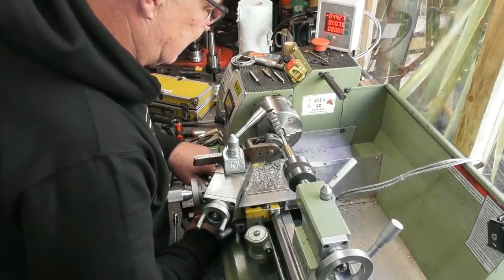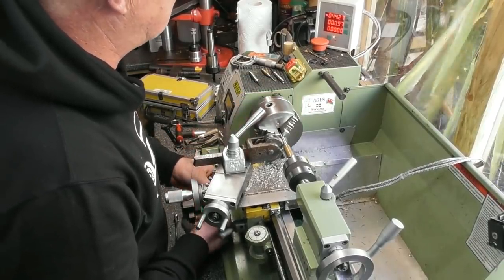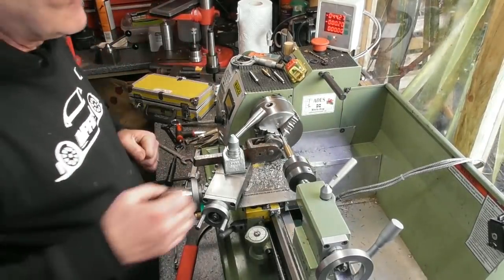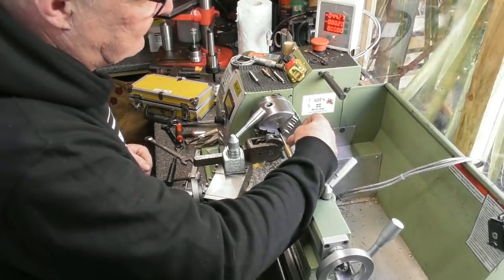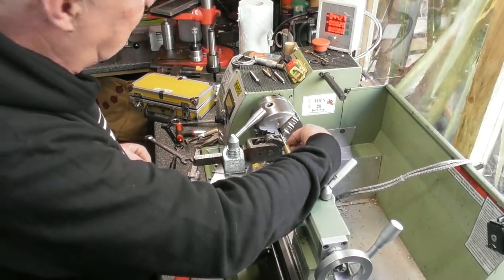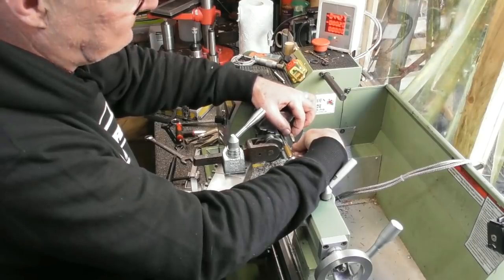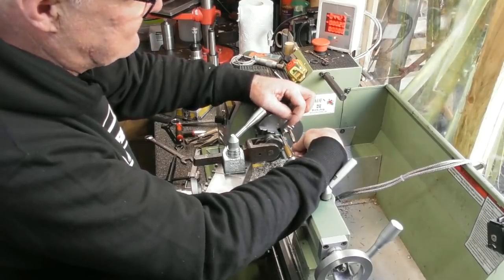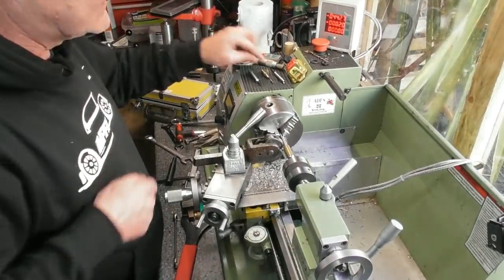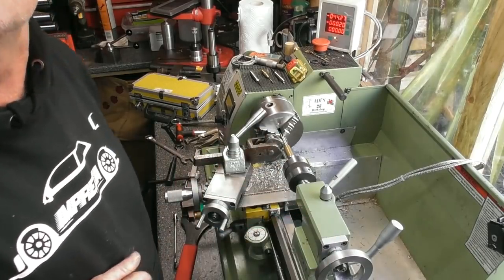I've set a stop on my carriage. I'm going to put a fine diamond knurl on, from where my knurling tool just misses the chuck. I've set the DRO to the extremity on this side. As I said earlier, it doesn't matter that there are grooves in there — the first groove will be machined away, and grooves two through five will all come into play. They line up exactly with the existing grooves on the original dart, so they'll just need to be deepened. Very lucky that the darts I bought worked out so nicely.